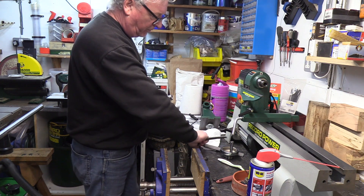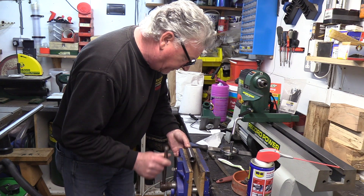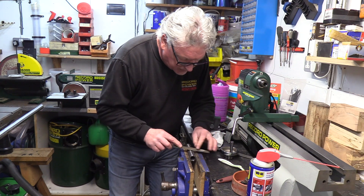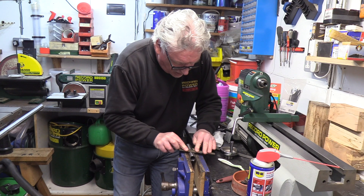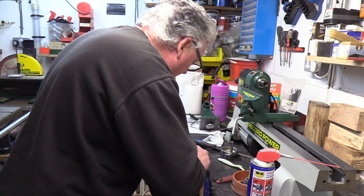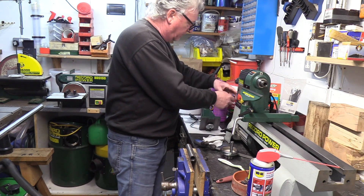This is a high tensile shaft but you should be able to clean it up quite easily. So I've got a fine file and what I'll do first is just go over the top — you'll see any shiny high spots on there. Just keep that a little clean up, and inside, just on the side, just gently on the side. It's not too hard. I don't want to make it any wider than it already is.